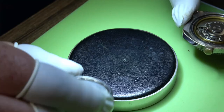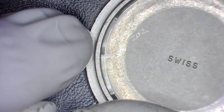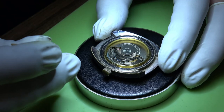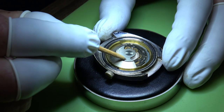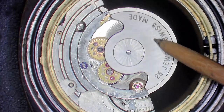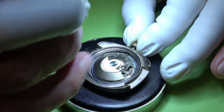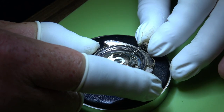Let's see what we've got on the inside. I always like to have a look at these to see if there's any markings, and there certainly are - no idea what they mean. Let's have a closer look at this movement. The automatic wind seems to be okay, there's no play in that. And it's an ETA 2472.